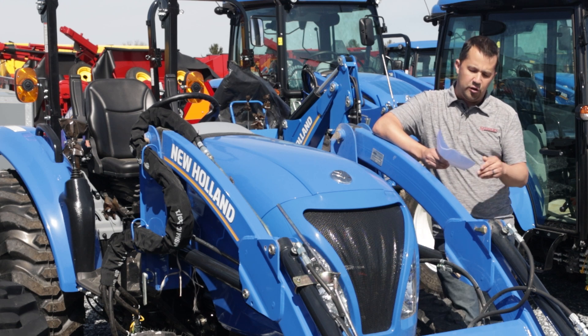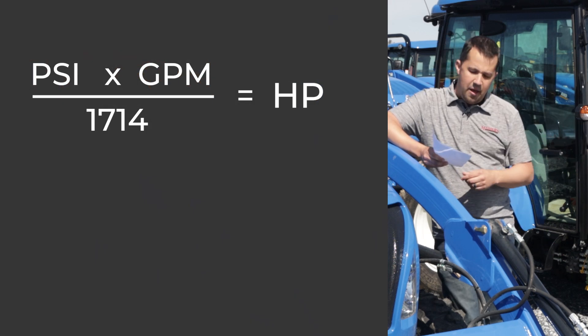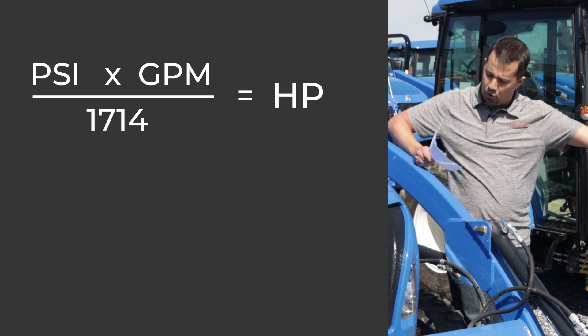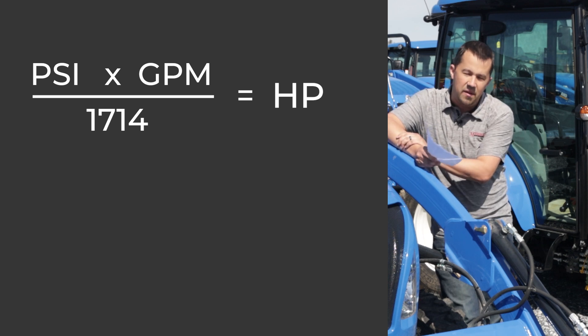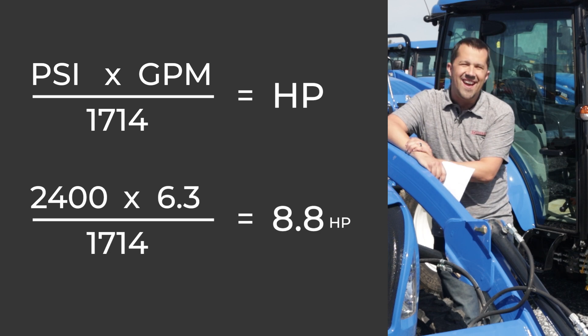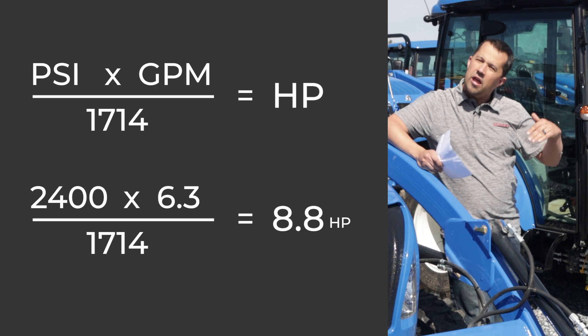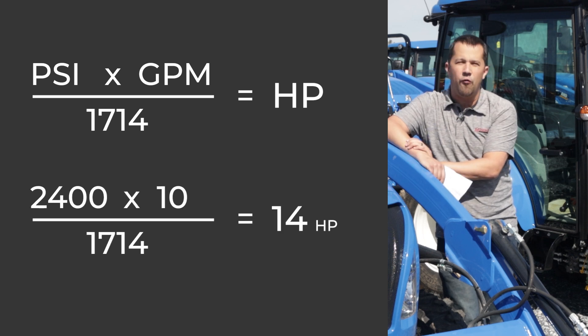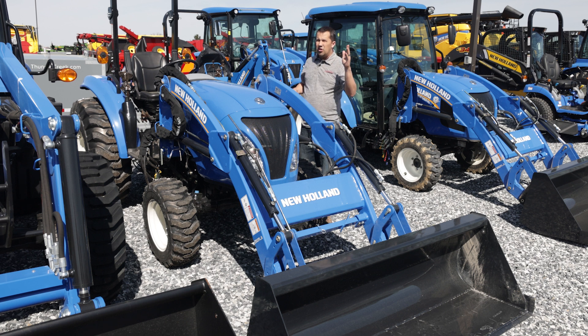If you take the GPM flowing through the hydraulic system, multiply it by the pressure, and divide by a constant, you can calculate how much horsepower is delivered. A typical small tractor at just over 6 gallons per minute — specifically the Kubota Standard L series — delivers 8.8 horsepower out of those front couplers. Even getting up into the 10-gallon-per-minute range only puts out 14 horsepower. We're talking tractors in the high 20s to nearly 40 engine horsepower, putting out 20 to 35 horsepower at the PTO. By mounting it on the front loader this way, you're getting only about a third to optimistically a half of the power you'd have if you put it on the back.